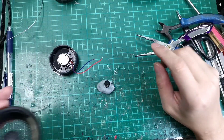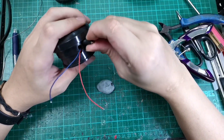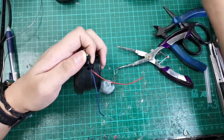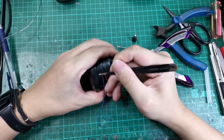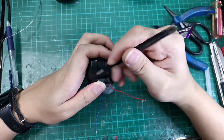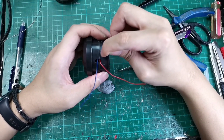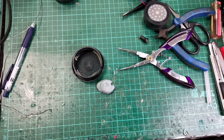You can hook it up and do the mod, but right now we are doing the sizing. We want to leave at least this much gap, so let's mark out what needs to be removed. Let's get a sharp tool - scissors will do, or just metal. We are drilling until this line. For the width, we will constantly enlarge it and slowly fit it in. For the Grado plastic series, we need to enlarge both this side and this side - both sides - although the more important part is on the back plate. We need a dremel, which is the most important tool.